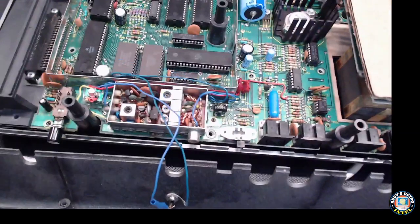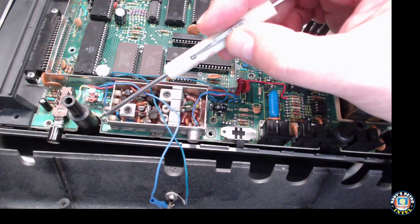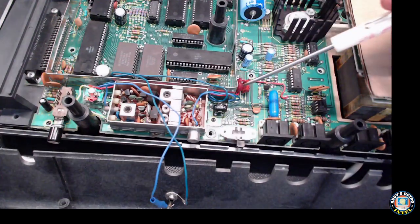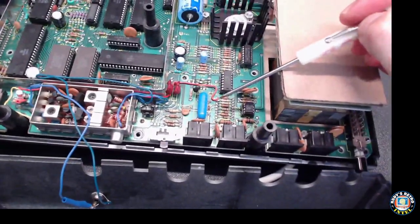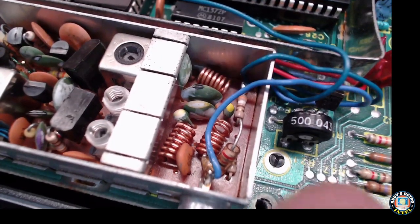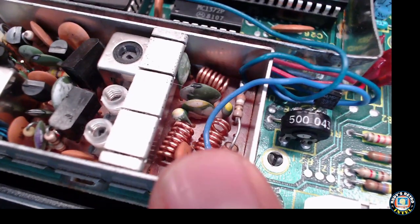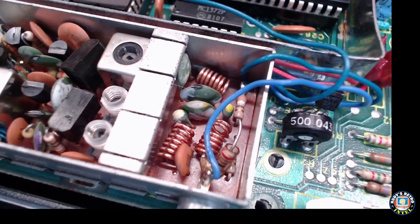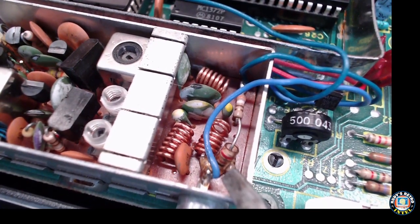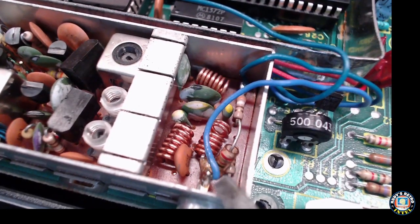The yellow wire is the actual video signal, the red wire is plus 5 volts which comes across — I picked it off a resistor right over here. The signal wire is attached right to the video connector on the RF modulator. I've cut the resistor that is there, which basically disables the RF unit. If you ever wanted to, you could solder that resistor back in and your RF modulator would work again.